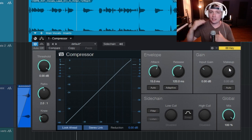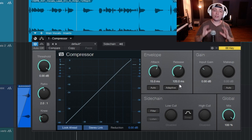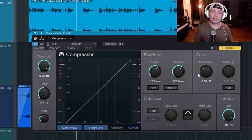As you compress things, they get a little bit quieter, and then you might want to make it up with the makeup gain. So as far as the input gain is, this is essentially how loud your cell phone is going into the Bluetooth of your car, or the old aux cable, if you remember those. So if you have your phone cranked all the way up, or at least setting it unity, sometimes it would actually cause distortion. You might have to like click it down like that one or that two. So you want to make sure that your input gain is sounding really good.